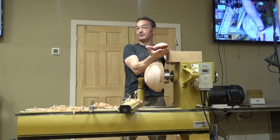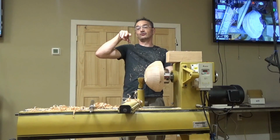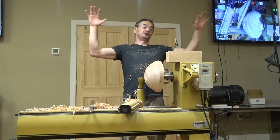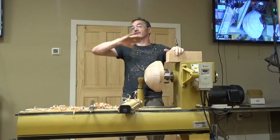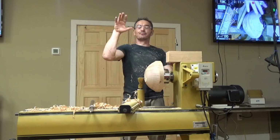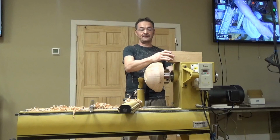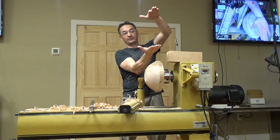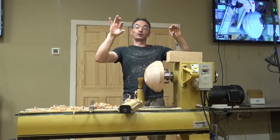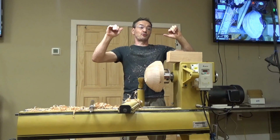So you can do that with hornbeam, and they used to use it for the weaving industry in Manchester. Manchester's where the Industrial Revolution started. That's where they used to have in Oldham these huge factories that used to do all the weaving for the whole world. Now there are no weaving plants there whatsoever, but the presses were still there. They used to import the hornbeam from Czechoslovakia, and then they compressed it overnight to half its size, and now it had a super density of 1.4, which is denser than any wood in the world. The heaviest wood in the world is 1.3.